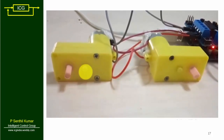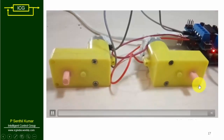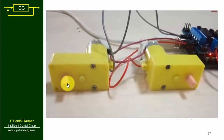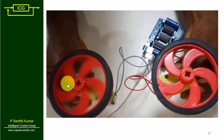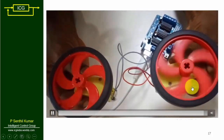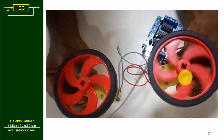You can see clearly: first motor 1 will run for 3 seconds, then motor 2 runs for 3 seconds. Then again motor 1 runs forward, but this time motor 2 will run in the reverse direction. I will attach wheels to the motors — now you can see clearly motor 1 runs forward then motor 2 runs in reverse. This is how you can interface a DC motor with Arduino using the Adafruit motor shield. Thank you.